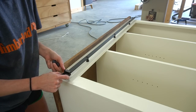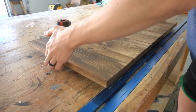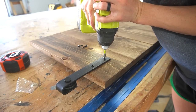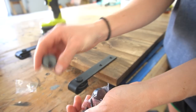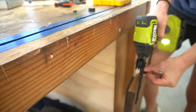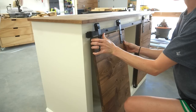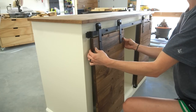I went ahead and placed the stops on each end of the rail, but I'll come back and adjust these later. For the rollers, I mounted them so that the bottom of the hardware bracket was about three and five-eighths inches from the top of the door, then used the included screws to secure them. This kit comes with anti-jump pieces — basically some plastic spacers that attach to the top of the door to prevent it from accidentally lifting up and jumping off the rail. You attach these with just one screw so that when you place them onto the rail, you can rotate them in place so they don't jump back off the rail accidentally.